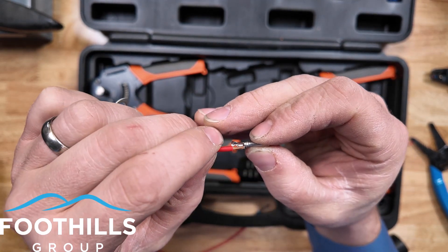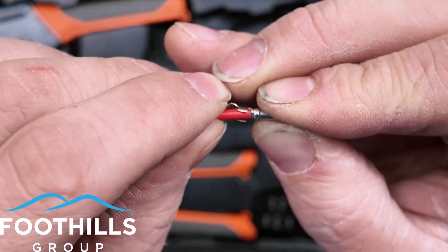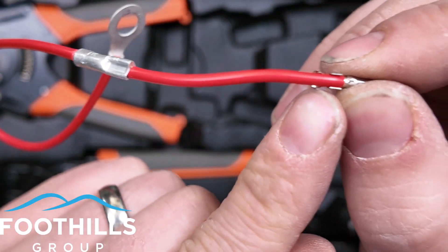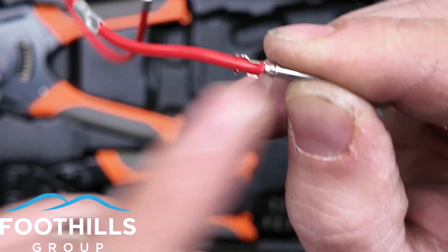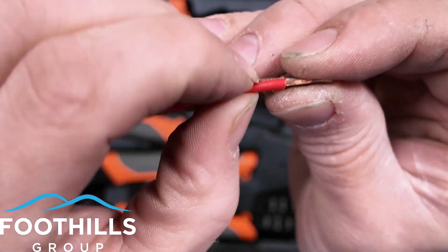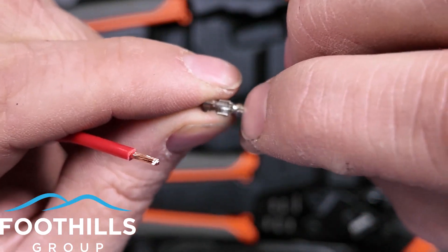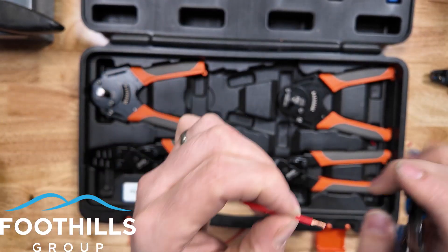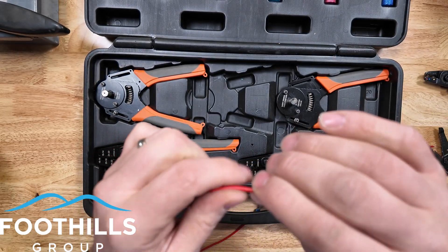When you do these open barrel ones, I stripped the same amount as the closed barrel, and what you'll notice is that when I stick this all the way in, this band right here is crimping insulation — and that's not good. It needs to actually be crimping onto bare wire, and the pins should go all the way in to the socket. So we need to strip more from this wire. We want to be just inside the barrel so it's a closed fit. Pull about double the insulation off. Just something to keep in mind as you're cutting wires — make sure you have enough insulation.